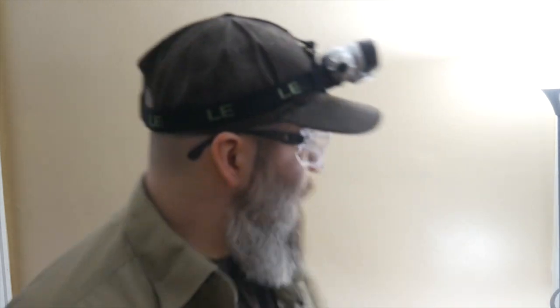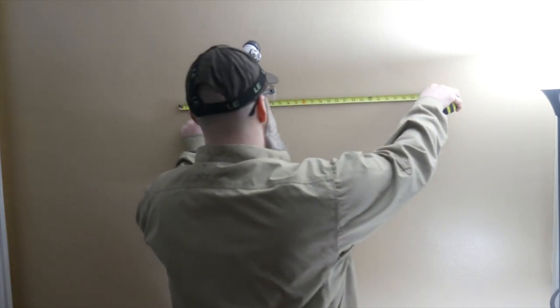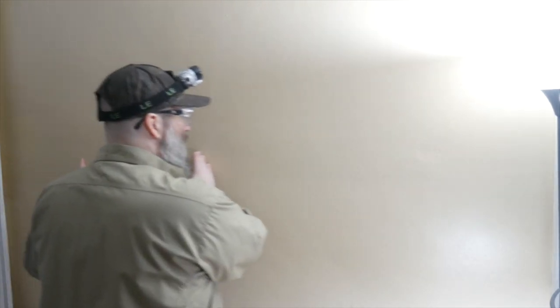That's where it gets tricky. When you normally frame up a wall, you put a stud, then you measure 16 inches from that stud and put another stud right there — that's usually how you do a wall. Now, if you have electrical boxes or floor vents, there are a lot of different things that can cause you to need to adjust how your wall is framed. For instance, if you're framing a wall with studs going across and then you get to a door, there's going to be another stud right beside it. So the trick is: where are the studs?